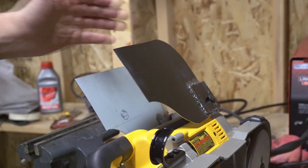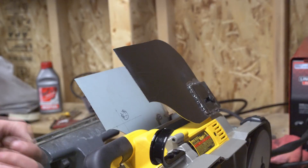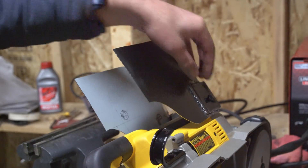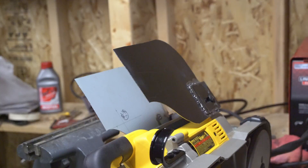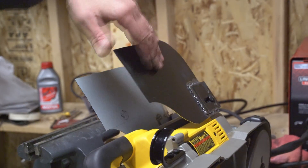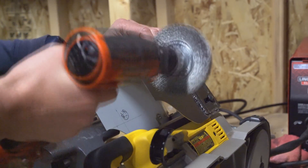This is just going to be one of the brackets for the top and I'm going to fix this onto the table before I work on the lower bracket. That's going to be really good because it lets me fix it and then adjust it minutely. I've also got the slots, so we can really set the tabletop out, position this to the top of the table slot, lock it up, and then it just stays there. Maybe we'll slot this bracket as well — who knows, we'll have to see. Now something you've always got to remember when welding is clean the metal up, because this is off a computer case and it's got this black paint on it — so just go along and take that off.